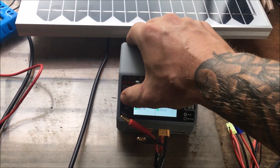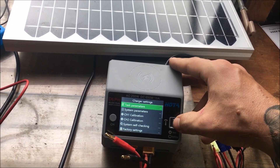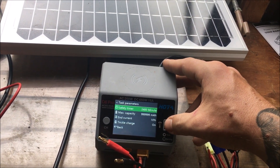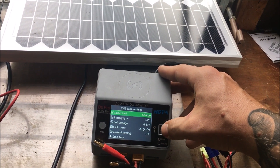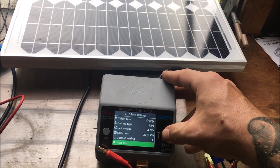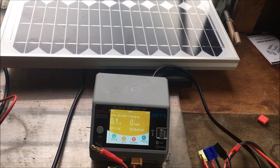Selecting the channel, setting task parameters — I'll select 'Charge LiPo 4.21 volts.' Starting the task. I don't want to balance it, I just want to charge it.